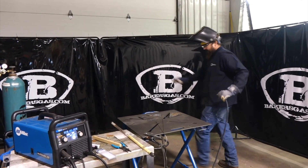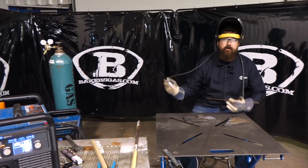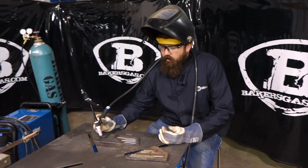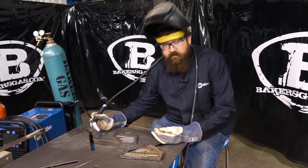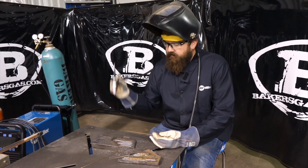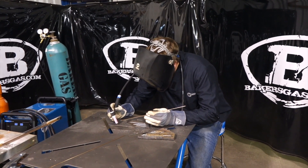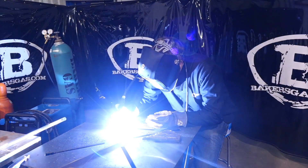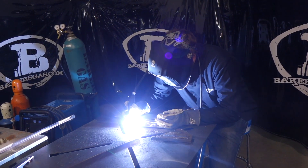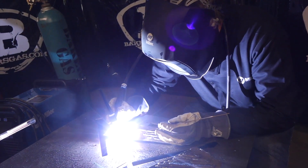Remember with lift arc, you have to lift arc. My pedal is on. Notice I'm touching the tungsten — no arc is being generated. The arc will not start until my foot pedal is pressed, and you'll hear gas flow. Right now you got gas flow, pedal's down. Let me show you how that's done. Pedal is on — you just lift, it touches, and then lift and you get your bead going. You just lift the tungsten.